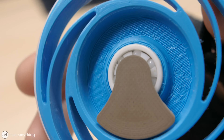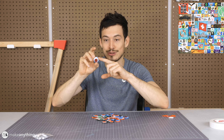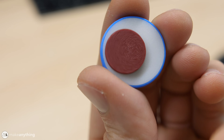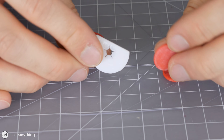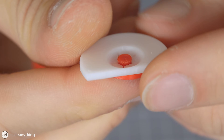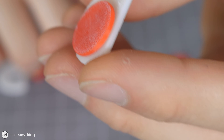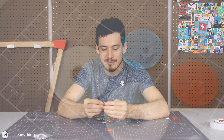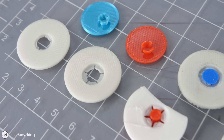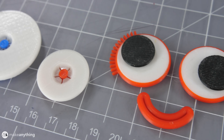Basically, the puck has a center disk that stays upright no matter which way it is, and a googly eye is kind of the other way around — the outside circle is mostly stationary while the inner circle bounces around. Here's my deconstructed googly eye, and you can see it's actually three parts. These two parts snap together and it's basically just a little hinge. But it was really not easy to come up with this hinge — printing little parts like this is not easy, and making all the tolerances perfect came down to fractions of a millimeter. I had to print a lot of different prototypes to get it to swing around loosely and be a good googly eye.